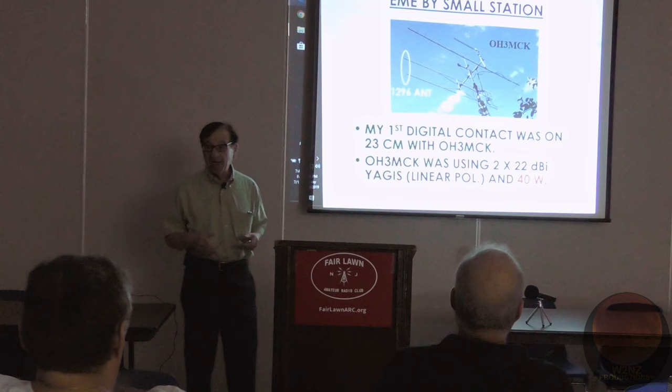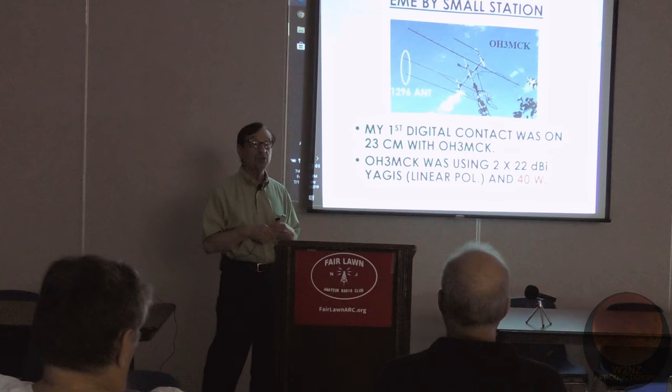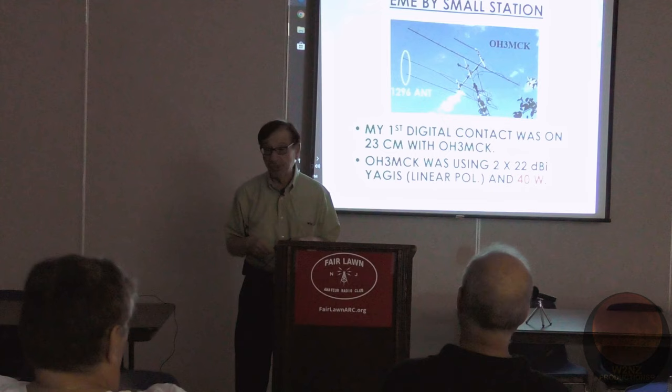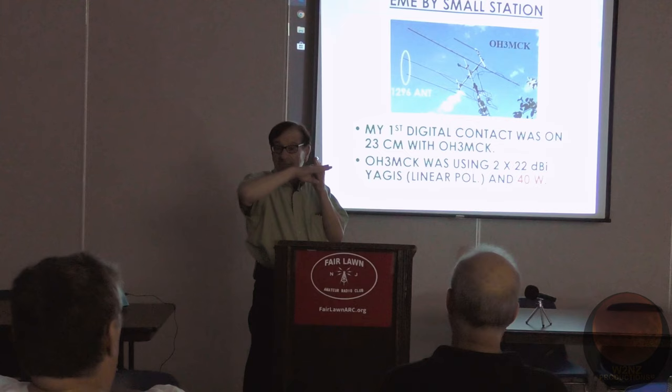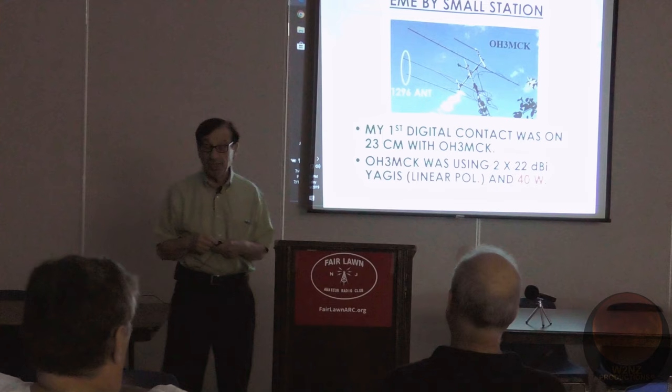And this was the early days, when digital techniques have been perfected quite a bit since then. And he was running linear polarization. That's something that you probably don't know too much about, but you know that antennas are horizontal and vertical. On 1296, a lot of the hams, the majority, operate what's called circular polarization. And when you work a station that is linear, you lose half your power. You lose 3 dB. So besides everything else, having this really small station and low power, he was running linear to myself, who was running circular, like most of the other stations he worked.